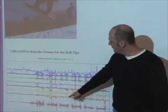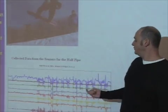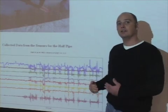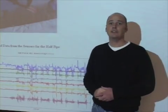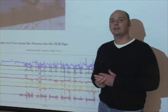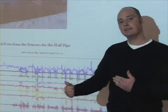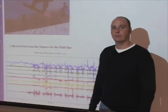When the vibration dies out, that's when the pro is actually in the air, so the board isn't shaking as much. Since that axis is time, we were able to tell the snowboard company what his hang time was — how much time he was actually in the air. We then tested many different boards in the half pipe, and by looking at the different sets of squiggles, the strain gauges told us how much flexion and vibration was going on with each type of board. We were able to feed that back to them for different materials and layups used in manufacturing.